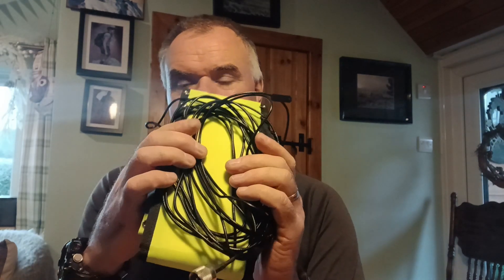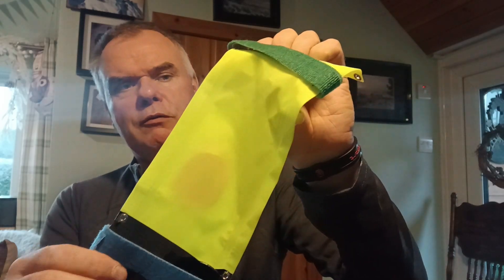Inside the bag there's a nice little high-vis velcro pouch so you can't lose it. We have heavy fabric with a load of RG-174 coax with a PL-259 on the end — I think there's about five and a half meters of that. Then we've got the antenna itself inside this inflatable tube, which actually has a matching unit in it. It also does 70 centimetres, but I'm going to concentrate on two meters today.